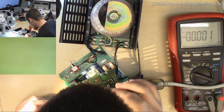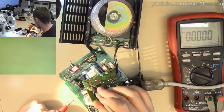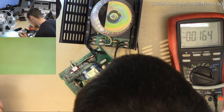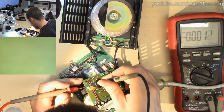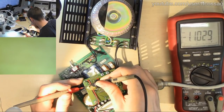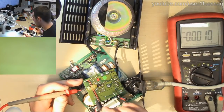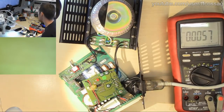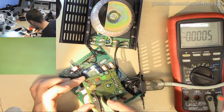The black and red wires are some kind of feedback input because they're going through a resistor into an optocoupler. Is that on? The optocoupler is enabled. There's 1 volt across the LED side, so it should not have any voltage across it on the transistor side. We need to get rid of this hot glue and verify that the optocoupler is actually working.